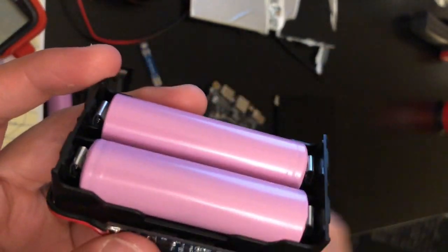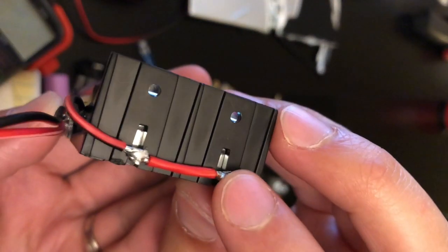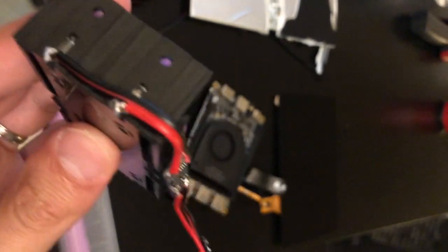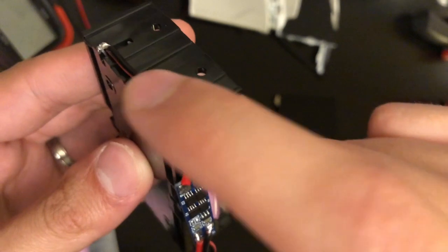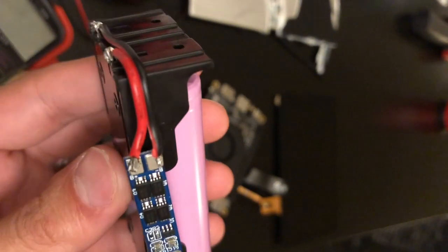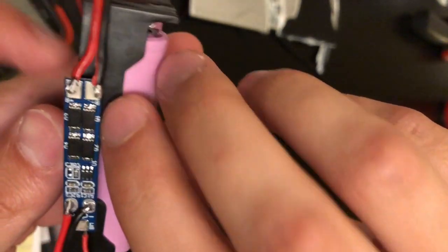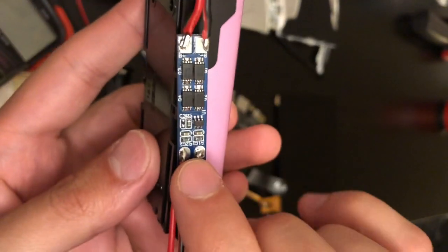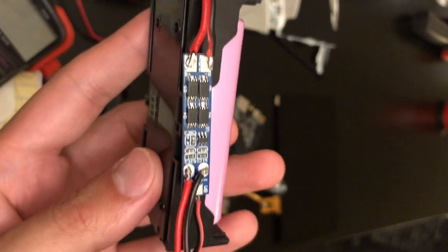Before you install the batteries, you're also going to want to take your multimeter and check for continuity between the midpoint terminals and the PCB. Check continuity between the negative terminal and the PCB, and the positive terminal and the PCB, to make sure you have a good connection. Most importantly, check to see if you made any shorts — check the resistance or isolation between the positive and negative leads. Make sure there is a large resistance, greater than five mega-ohms, between those two contactors.